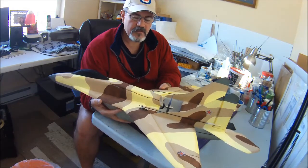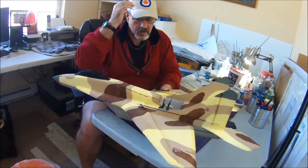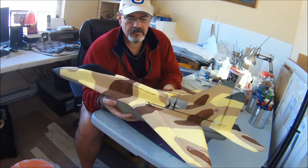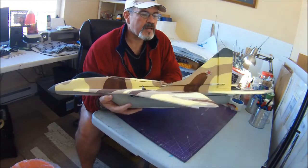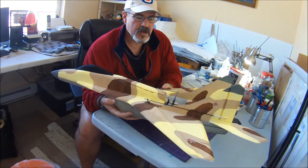I could feel that the plane was draggy. It was sort of like the motor could give me a lot more, but I just would hit the drag limit. What I found comparing one plane to another is, for the extra hour or so fussing around sanding it, you probably get about 6 to 8 extra miles per hour in speed.